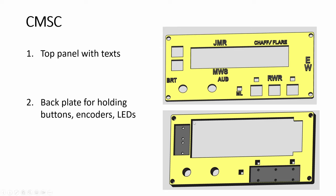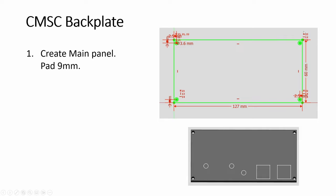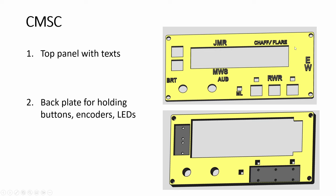Now this one, you need to place the LCD and there are a lot of tricks here. The top part where you put the push buttons, you need to recess the top down so that when you put this over, the top part of the push button is not pushing this up — this needs to sit flush. So start with a panel. This is a bit taller than most people build it, but really the space, height and width wise, everything is very tight.